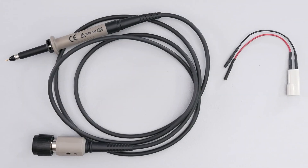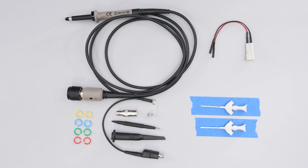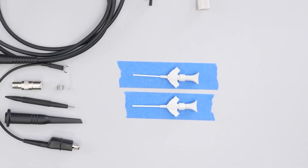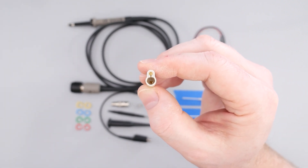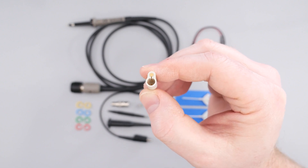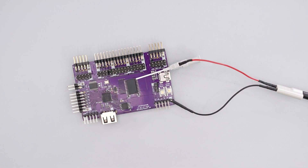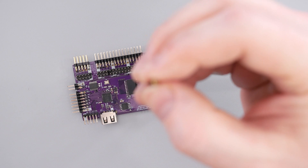The setup is a passive voltage probe and the twin lead adapter. The probe comes with normal passive probe accessories, and the adapter comes with a couple of SMD test clips. Inside the adapter is a little socket or hole where the probe tip contacts. A metal strip up the side touches the ground collar. Once attached, the test leads connect to either a header pin or the SMD grabber. I think it's okay to use header pins.